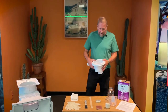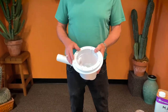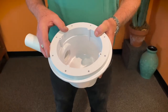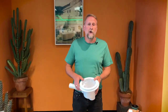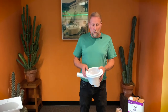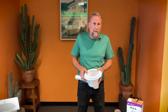Here I have a drain, which is located in the bottom of your pool. The drain is also made out of the same material as the skimmer, so if you get a crack in your drain, you can also schmear a drain — but it is very important that it is dry. Repairs on drains work for fiberglass or concrete pools. If you have a vinyl liner pool, do not drain the pool as you can damage your liner. You would only make that type of repair when changing the liner, and at that point you'd just put a new drain in.